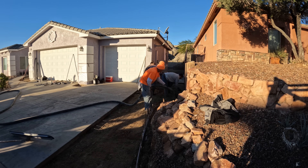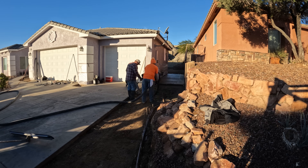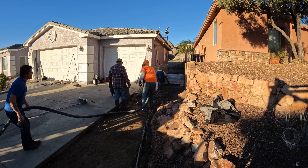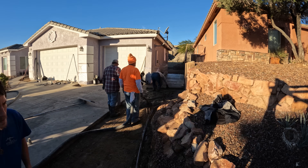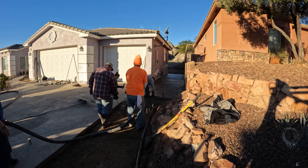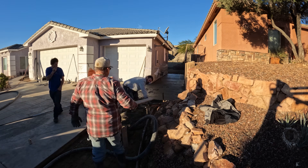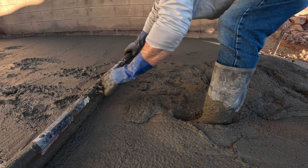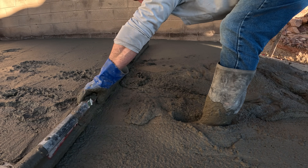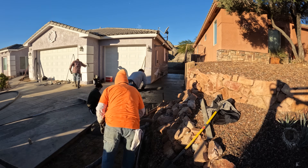So what we have here is Kenny on the pump, Doug my brother pulling the wire up, our camera girl Jade, and Eric pulling the hose back. I'm the guy screeding the concrete, and what I'm using is a six-foot-long Milwaukee red stick. That way I can actually read the level as I'm screeding, just to double-check my slope on the way out.